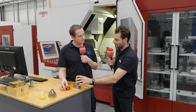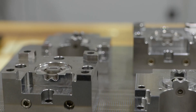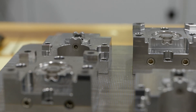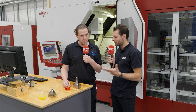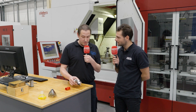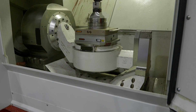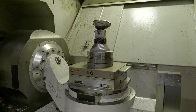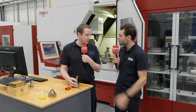Let's talk about this component. There are a lot of requirements placed on it. A big requirement is surface finish — this is a fully polished surface finish coming straight off a high-speed machine. Also a big requirement is flash-free; in other words, all your shuts have to be good.